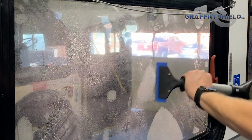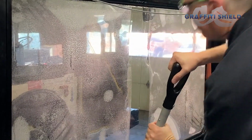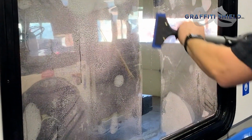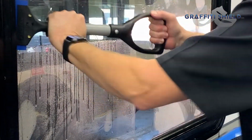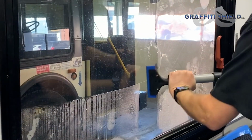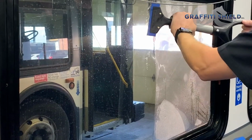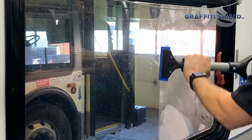And this is our heavy duty squeegee. I'm going to divide the window in half so we can bring the moisture to the edge. You don't want to squeegee up because that'll bring contamination and debris down. So just go right to the edge, and then an overlapping motion. And we'll continue to squeegee to the side. And then I always like to do it a second time just to make sure I did not miss anything.